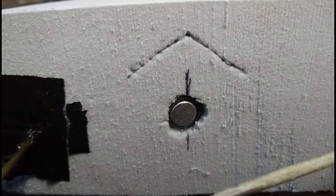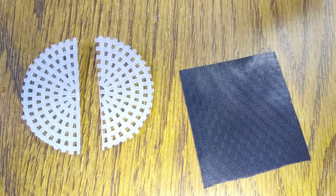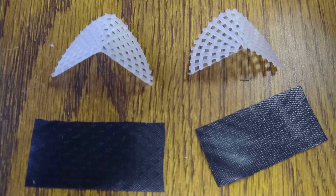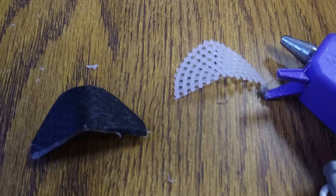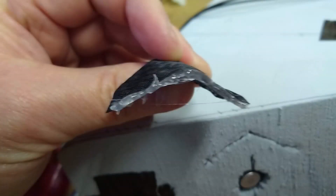I also wanted to keep water off the mics. Even with the windshield, I didn't want the risk of water dripping down onto them. I had some plastic yarn canvas from making a blimp for my shotgun mic, and I also picked up some round plastic canvas pieces along with some Hyper D 300 waterproof fabric from ripstopbytheroll.com. I took one of the round plastic canvas pieces, cut it in half, and bent each piece in the center. Next I cut a piece of the Hyper D 300 to the size of the plastic canvas halves and used a hot glue gun to attach the fabric to the plastic canvas. I then marked on the foam where I wanted the slits, made slits with an exacto knife, and glued the edge of the plastic canvas into the slits, also adding glue to the top and bottom where the canvas and foam met.